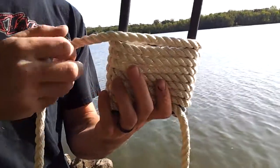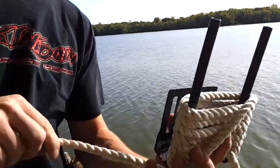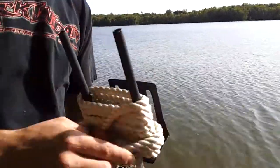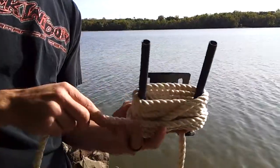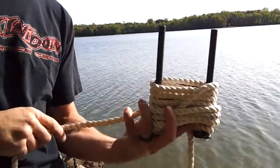This mount is designed to hold 25 feet, which will be 2 thicknesses of rope — 2 coils. When you get your first coil done, make a transition back down to the bottom of your mount and start again at the bottom. It's very crucial that you always wrap your rope from the bottom to the top, so when your sled is underwater or your equipment is underwater, it's pulling the rope from the top to the bottom and that will eliminate snagging.